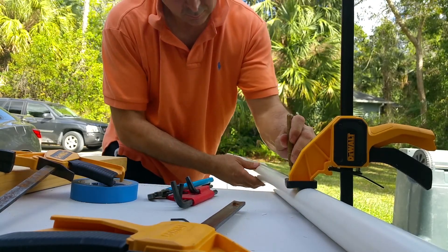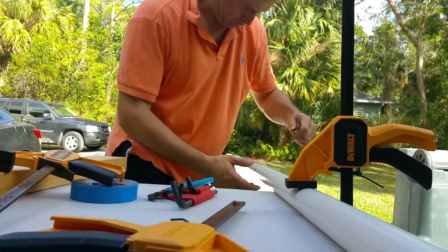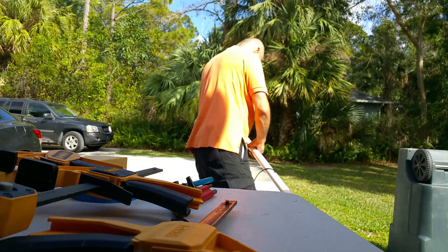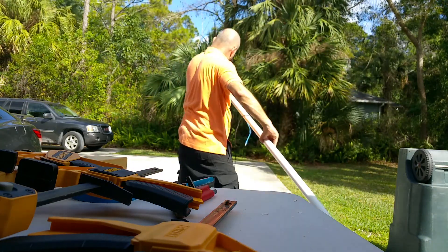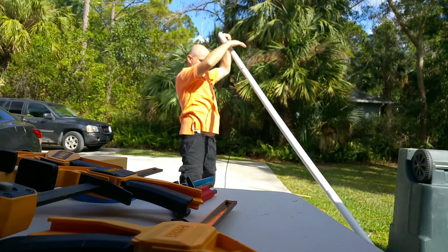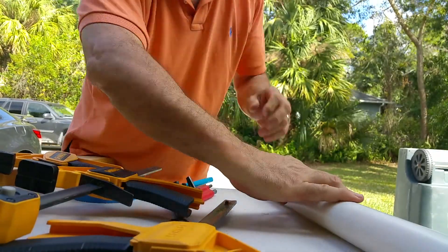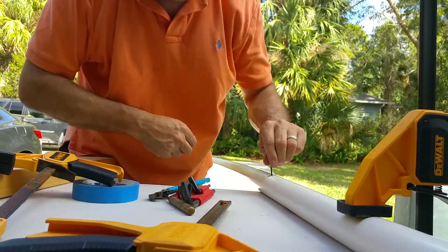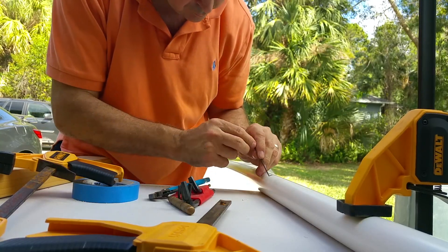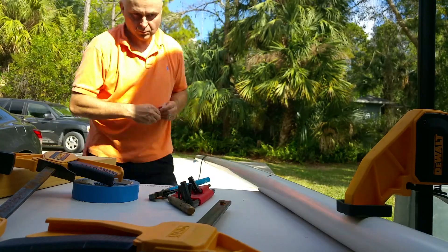The reason I'm doing this is I wanted to get my antenna up higher so I get better range and can see more aircraft. This is sub-$10 worth of equipment to make it happen, and I'm very excited about it — I've had excellent results. I may actually go to Home Depot and get another coupler and 10-foot length to boost my mast up another 10 feet. It does look stable right now; I'm just worried about getting it too long and unstable.